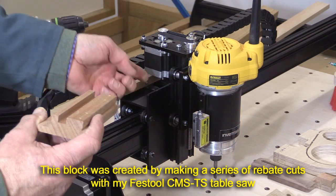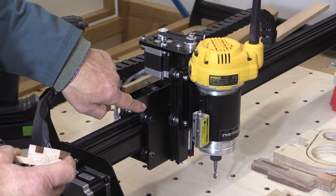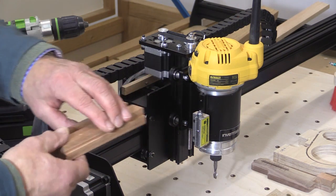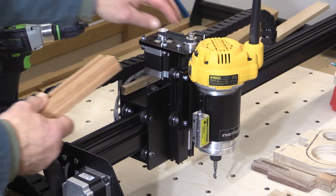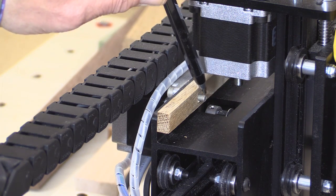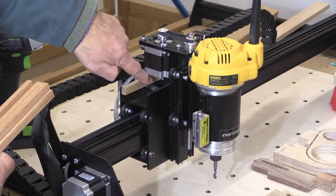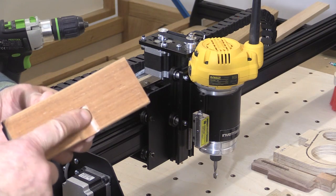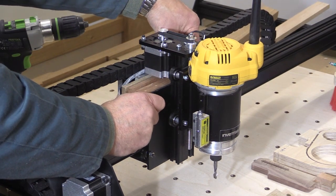Also, at the back here, there are the heads of some screws, so I've had to create this little bit of channel here as well. This section has very slightly curved corners, so my piece of wood has curved corners here and here all the way along. If one makes this carefully, it will just fit in very easily. Looking down here, you would see part of the stepper motor and its pulley, which has the drive belt for the X carriage. I'm not certain whether that could interfere with this block, so underneath here I've created a cutout section exactly where that pulley would be. I think it's actually free, but it's just a precaution.